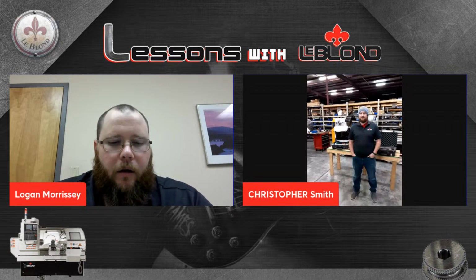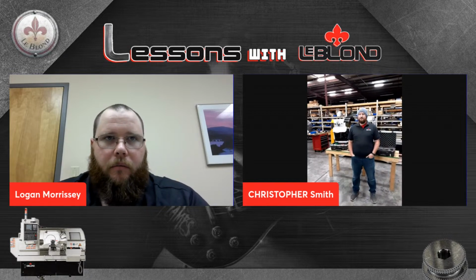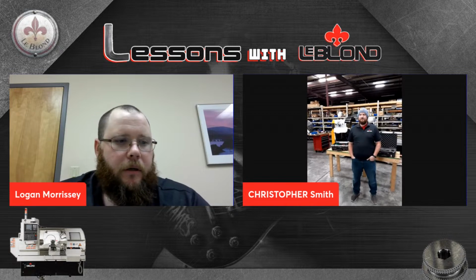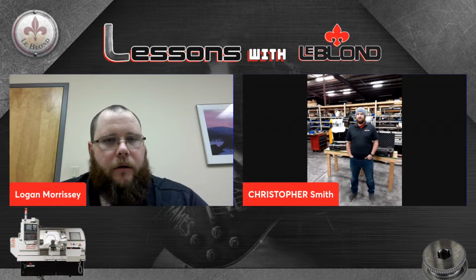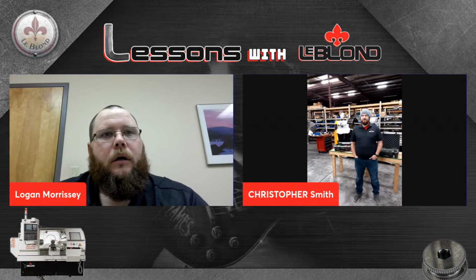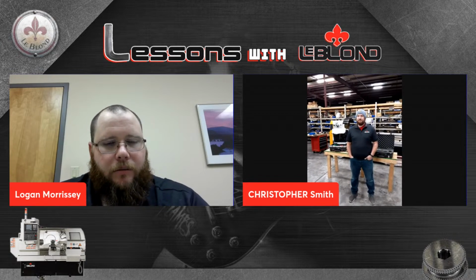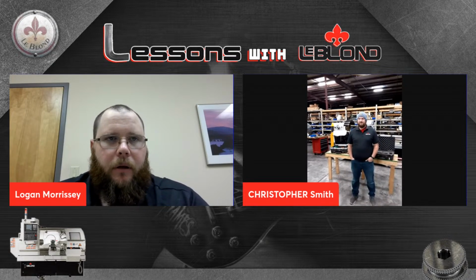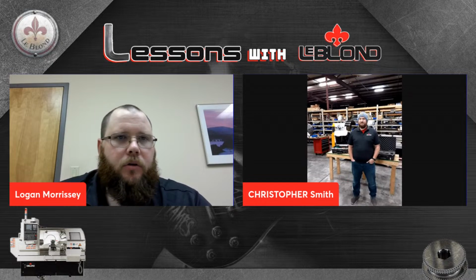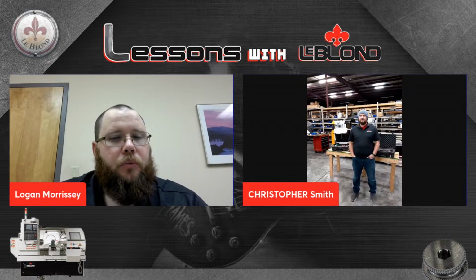And then the vertical saw, the LVS 50, comes with a butt welder with an integrated annealing unit. So if you need a new blade on, you can get all that done right there on the machine. Cut it, weld it. The max throat capacity on that is 20 inches. The max work height is 12.2, and the table on that comes out to 24 by 20, and the table does tilt 4 ways, 15 degrees each way.